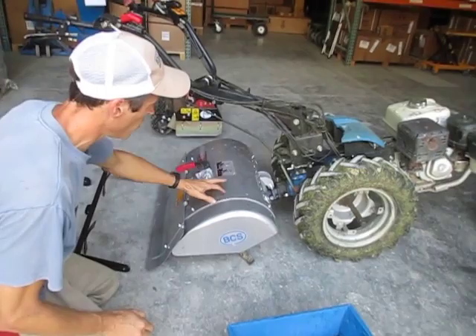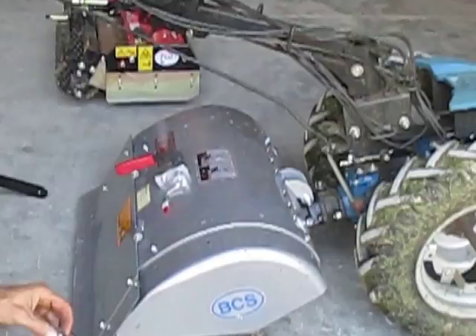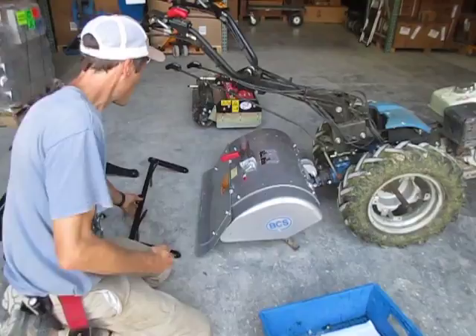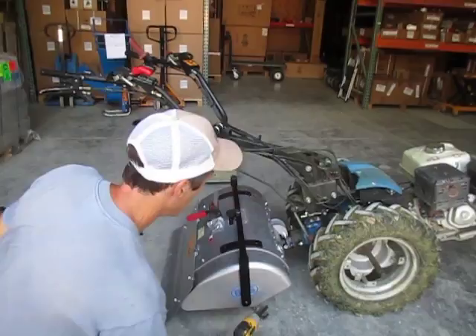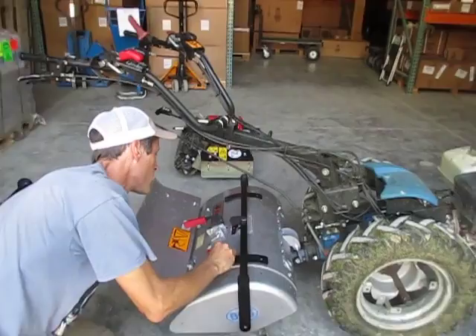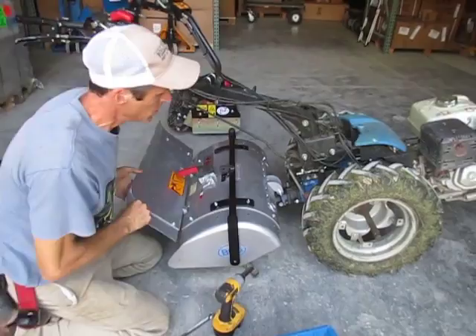Let me walk through the assembly process. Normally you would have bolts in all eight holes on the tiller hood. I've already removed the center two. We will be supplying this accessory with longer bolts because this bracket is going to bolt in right here — you need a slightly longer bolt. We'll discard the originals and put it on with the longer bolt. These are 20-millimeter bolts, roughly three-quarters of an inch long. Use the same nuts that came with it. Put the bolts in from the bottom up — it's a lot easier than the other way.